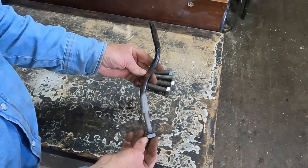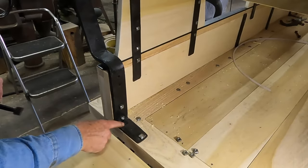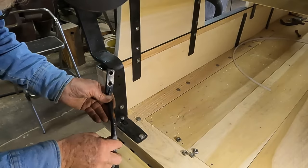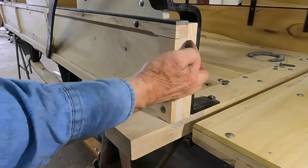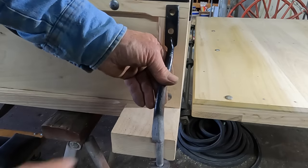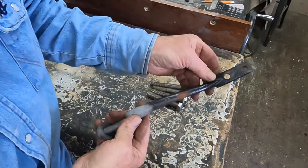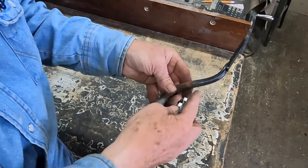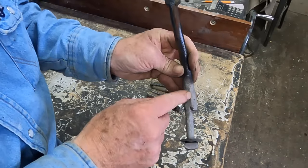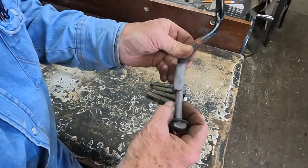And then this is the side brace at the rear corner of this box that I need to duplicate. Well, these irons on the back corner box have two holes in them, which correlates with the two holes in this brace. Well, these two holes right here are drilled through this corner, and then this brace gets bolted to it. It'll mount up about like so with this bolt going right through this mainframe. Well, these type of irons were oftentimes drop forged, and you could buy the blanks and finish them as you needed. This one here looks like this portion was taken from an old side brace, and they split and welded this half inch bolt into it.